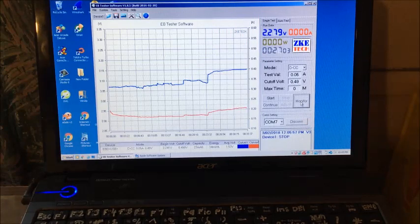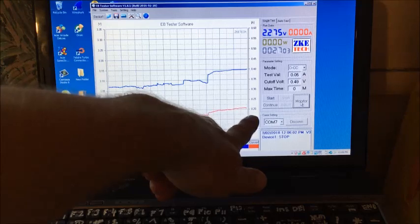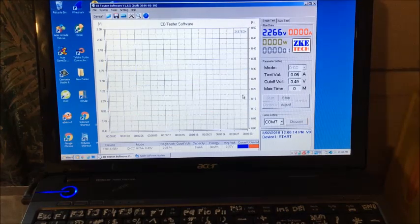Charge curve number 8, we made it to 3.1 volts this time and we went back up to 200 milliamps. Okay, we're all ready for a discharge, got the leads all swapped over. And starting discharge number 8. Now, hopefully we hold 2 volts for 2 minutes. This was the 33 minute charge. At 3 volts, it managed to climb up to 3.1 volts.